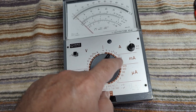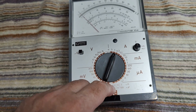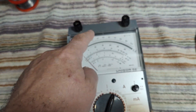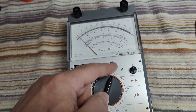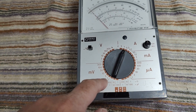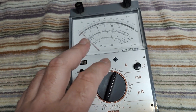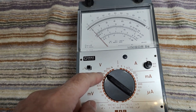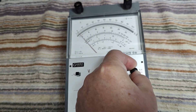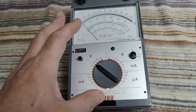In all those ranges of both current and voltage, it is using very little energy. In current, the voltage drop is very, very little. There's a sense resistor that is very low value, then it amplifies and displays. It's the same in voltage — the input resistance is very, very high, and it amplifies and drives the meter using the built-in batteries. So you can't even measure any voltage at all if you don't have any batteries in it or if you didn't turn the on-off switch on to enable the built-in amplifier.